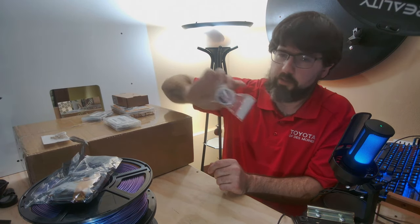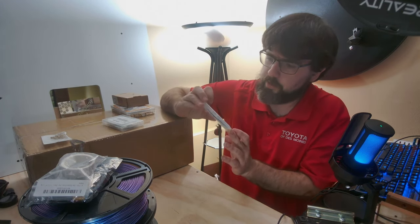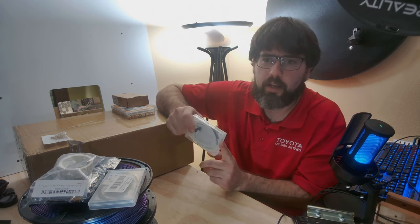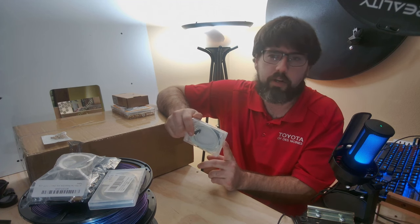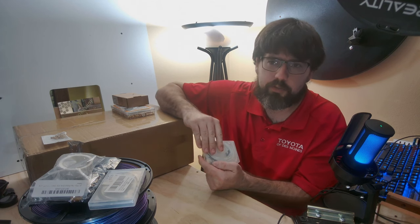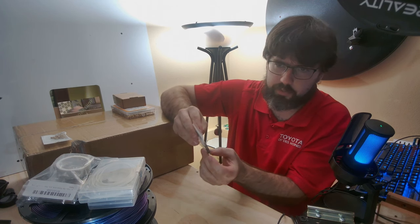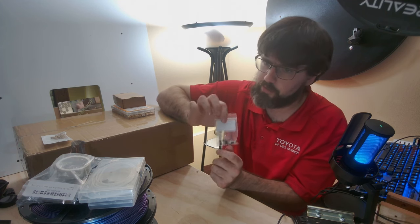I also have the ribbon cable needed to run this screen, as well as some RGB lighting and thermistors so I can monitor chamber temperature and hotend temperatures. I will be running the Rapido 2.0 Ultra High Flow on this machine because I want to do high-speed printing, and it will allow me to check for heat creep and chamber temps more accurately. I also have some micro switches because I want to run a tap setup, though I may end up just doing standard bed leveling.